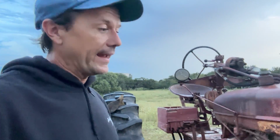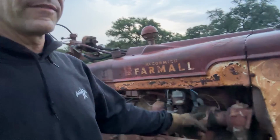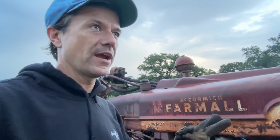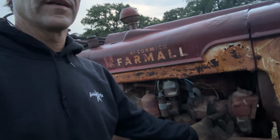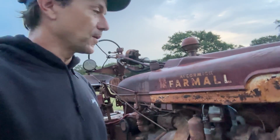I have a 9-speed M&W transmission for an H. And on my way home from Texas, knowing that I have this H, I was browsing Marketplace for a Super H or 300 or 350 live hydraulic pump. And I found a guy in Iowa who had not only the pump, but he had the stronger camshaft gear. He had the timing cover and timing backing plate that I need to convert this thing. The only thing he didn't have is the hydraulic manifold block. So that's cool. That's also going on this thing.